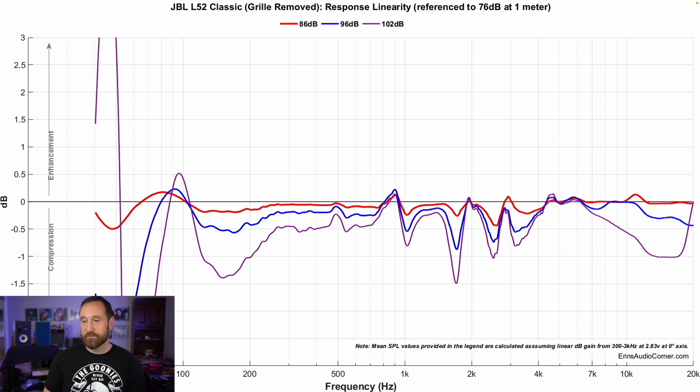Here we go with compression. This is kind of all over the map, kind of like the frequency response. It goes off the charts below about 70 to 80 Hz, which basically tells you that for a five and a quarter inch woofer, you're not going to be able to push it super hard. The rest of the distortion region through here — I find it interesting that it's so wonky. What I'd typically expect or hope for is that these lines would be somewhat linear. In an ideal world, all the color lines would be stacked on top of the black reference line, meaning unlimited dynamic range where increasing volume doesn't change the speaker's response. In the best case scenario you'd get a more flat compression chart, whereas this one is bouncing all around.